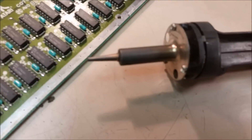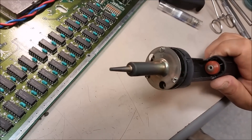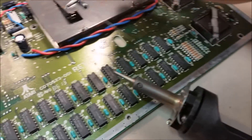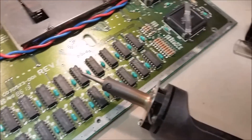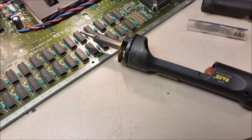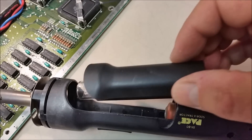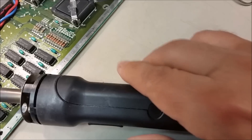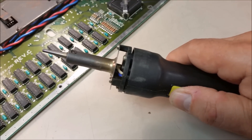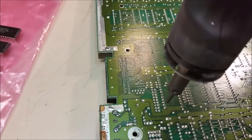One thing to know is that these tubes plug up sometimes. What I usually do is take a resistor lead that's approximately the same size, shove it in there while I'm sucking, then clean the tube back up and it starts working pretty good again. After you clean your tube, you stick it in the holder, put the holder in, release the side catch, then you can heat up your solder joint and suck it dry.